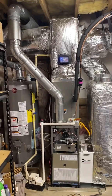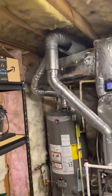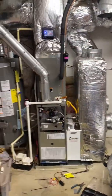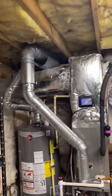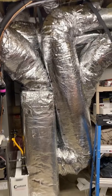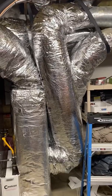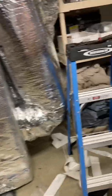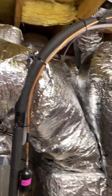Here's a little update on how we're looking — I have three ducts to connect: these two, and that one hiding behind the flue pipe, and we'll be done. Then I just need the mastic. This came out nice and clean. I'm gonna have to run that 10-inch across the top — I'll strap it up and make it look good. Got that duct work done, put an elbow up there, an elbow down there, there's also an elbow on the bottom. I ran this one in front — we'll get some flashing so it's not touching the flue pipe. Not bad for what I was working with.